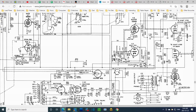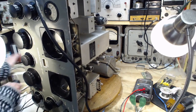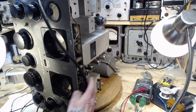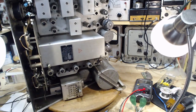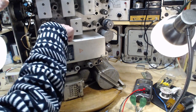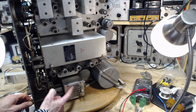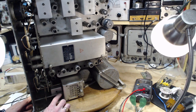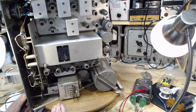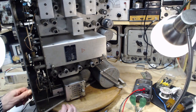I have trouble with the beat frequency oscillator right now — the last time I operated the radio there was a tone coming out. I need to get that can off — that's the bottom line. Let me unplug here to be absolutely sure there can be no power in the radio. These cans usually have screws at the bottom holding them. It looks like I have to remove this mechanism — it's just a linkage that controls which crystal you're selecting. I have to open these up to get it off.